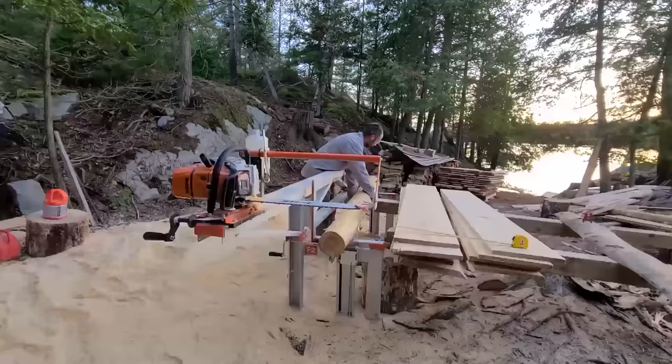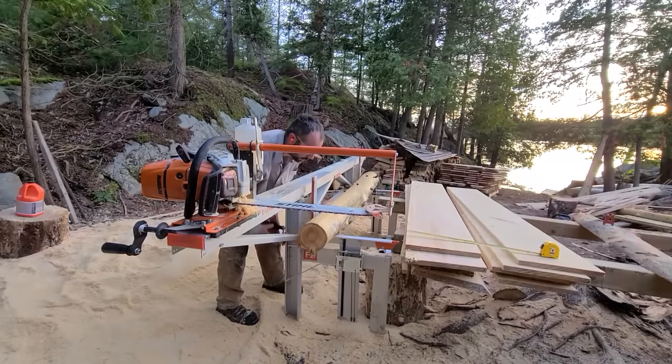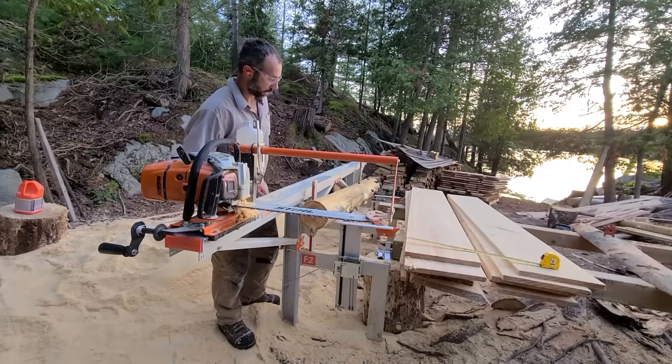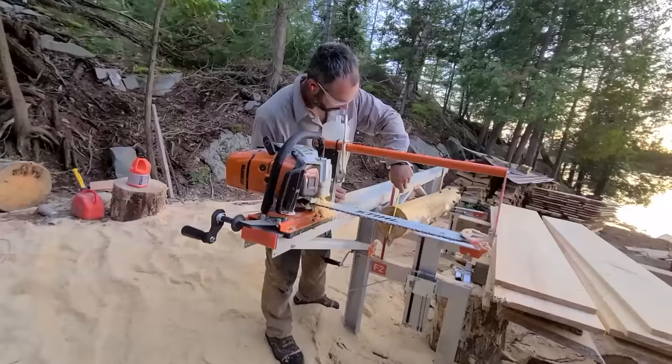With an Alaskan style mill, there would be no way to do a log like this, other than maybe just to mill it in half if you wanted some half rounds. Because you need somewhere to screw supporting plates on, you just can't take a small enough top cut to make a log like this useful. But with this guy, we should be able to just slab off the bare minimum, just enough to square this guy up and get a 4x4 out of the center of it.